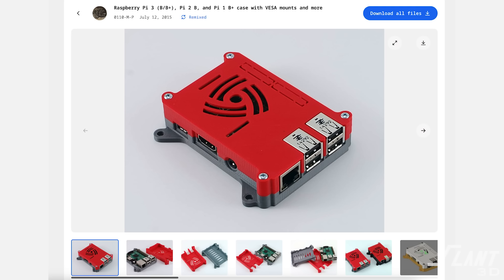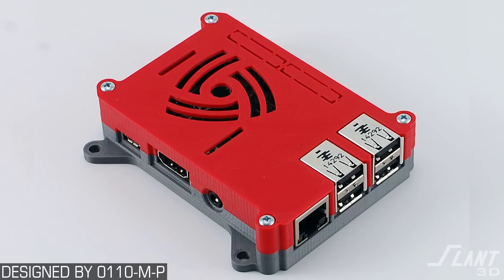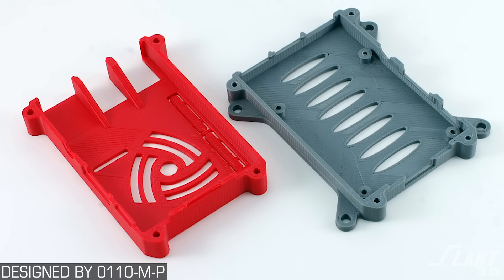The Raspberry Pi 3B+ / Pi 2 with VESA mount — having that custom mounting capability is really useful. This design is really sleek because it has no actual bumps coming up out of it. From a general design standpoint, I really like it. It has screws holding it together, but with the quality of this design you could have the lid and the bottom snap together and eliminate those four screws. Also, you don't need four screws — you only need two to hold a lid on. Kill two of them and have the other ones just have finding features, and you reduce the complexity of the part and the additional assembly. The rest of it is really slick, but again broad surfaces on the bed — you'd want to figure out a way to print this up on end.